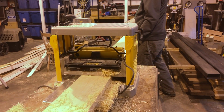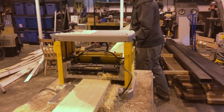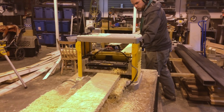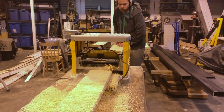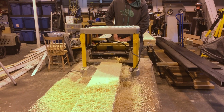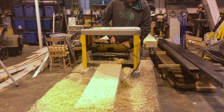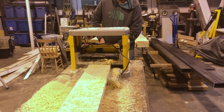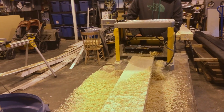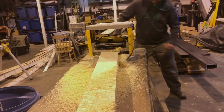So the first thing you need for your slat wall is some 2x4s or some 2x6 boards. You actually could use MDF to make this feature wall as well. We didn't because we were debating whether we wanted to paint our slat wall or stain it, and if we wanted to stain it, we needed to use real wood. But if you know you're going to paint your wall, you definitely can use MDF and you don't have to worry about all of this prep work.